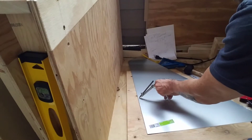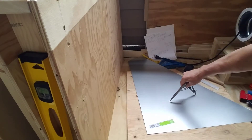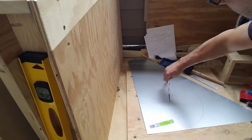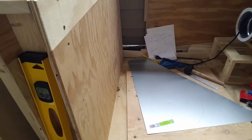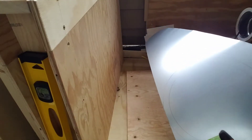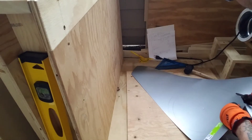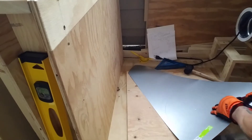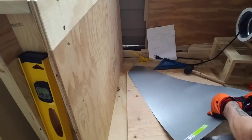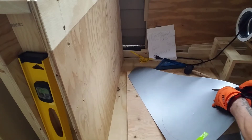On this second video we're making the upper part of the cyclone — the baffle. I'm going to lay out the very top of the cyclone out of sheet metal again. I'll draw a circle, cut it out kind of like a pie shape, and bend the tabs down so it can sit on top of the cyclone. I actually drew two circles: one is my cut line and the other marks where to bend the metal down for the tabs so it sits nice and flush on top of the upper chamber.